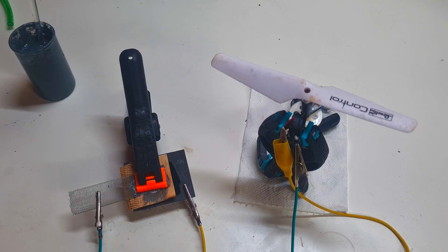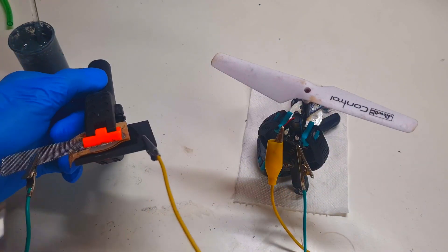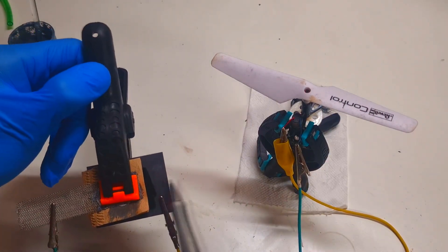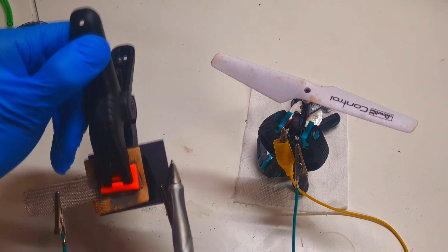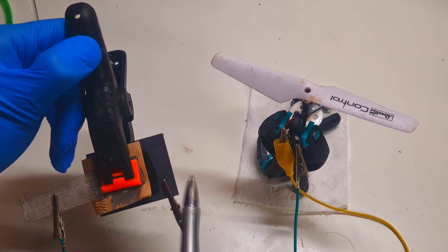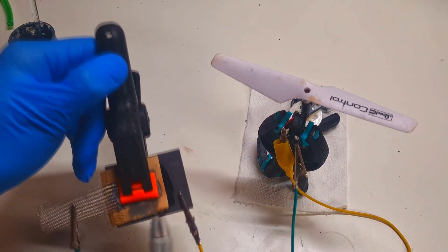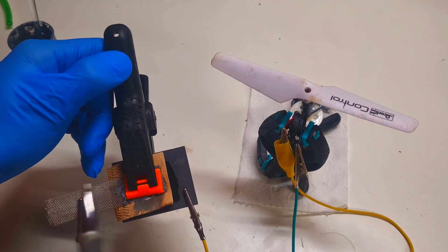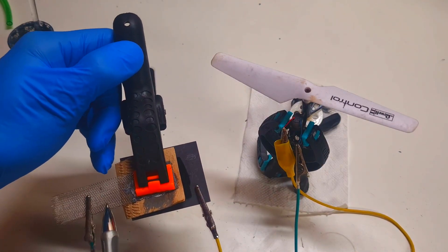Hello everybody. In this video I will make a zinc-air battery which can be mechanically recharged by swapping the negative zinc slurry. Here I have my first test cell for this project — a really basic zinc-air battery with a sandwich-like cell design. The positive current collector is made from a graphite plate, then the air cathode is made from activated carbon felt, with a separator on top. On top of the separator I put the negative active material, which is some zinc slurry, and the negative current collector is a stainless steel mesh.